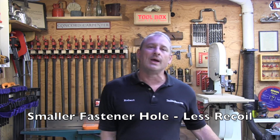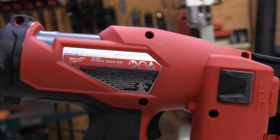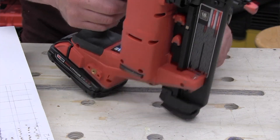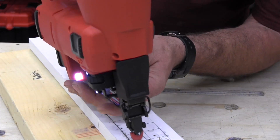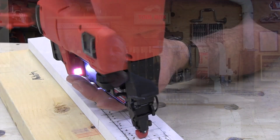This tool has an inner cylinder with a nitrogen air-spring mechanism — a piston and an outer cylinder — and the area between those two cylinders is where the nitrogen lives at a specified PSI. Milwaukee chose nitrogen over air because it's less likely to result in condensation and corrosion of that tank. The brad nail fires quickly because the striker is always pulled back and ready in the tank. Once the trigger is pulled, the pressure fires the striker and piston forward to sink the nail. Once the firing sequence completes, a motor spins a rack-and-pinion system that ratchets back and resets the firing pin.